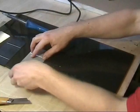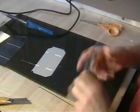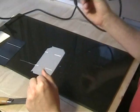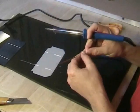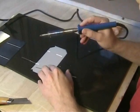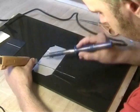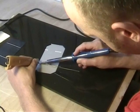You can see it can be a little bit tricky, but you do get into a rhythm of getting this flowing quite consistently once you've done a few of them. Same thing for the back side. The importance, really, is a lot to do with the soldering iron, because smaller irons don't really keep the temperature very well — the tip is too small. Whereas this one, you can see, has quite a big tip. You can almost tell when you're using it: running a continuous piece of tabbing wire, it's permanently trying to keep the tip hot, putting a lot of energy into the solar cell and even into the porcelain.